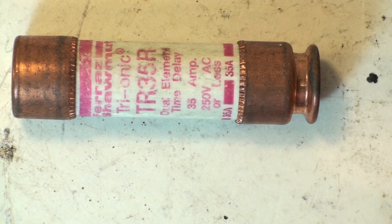You can go smaller, although that's generally not a good idea because it may nuisance-trip on you. Remember, use that same size fuse that came in it — don't cheat by 10 amps or something like that, because all it's going to do is heat that wire, and if it heats the wire and burns down the house, that wasn't a very good deal. Take the fuse to the hardware store, get the same thing. Don't put a single-element fuse in where a dual-element time-delay was — because it'll probably kick itself off. Put in like for like, every time. And that's the fuse.